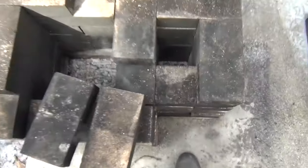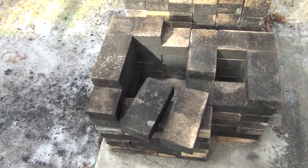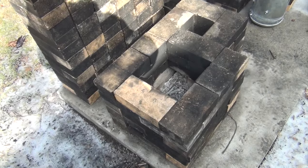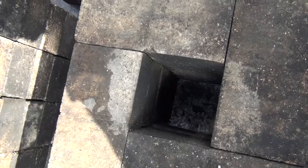So, okay, let me continue to break it down, and I'll show you how the wood and the gases get into the riser, the flame, in other words. There's the air hole again, and the idea here to get into the riser is just a half brick. No, it's 2 layers. It's two bricks by a half.